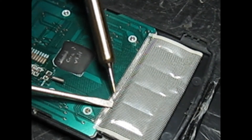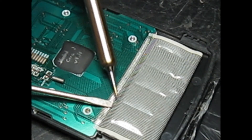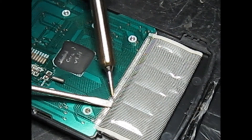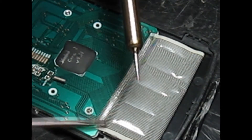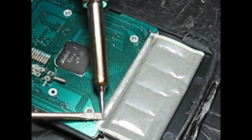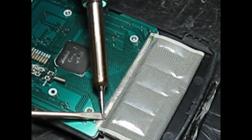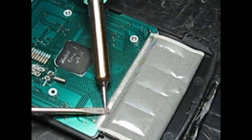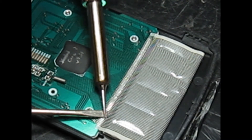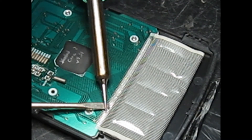Now, it doesn't always work, and you may actually have to increase the heat a little bit. But for now we're going to try and just hover over them, being very careful not to touch those pins themselves. What I'm doing here is pressing the soldering iron up against the screwdriver head itself, giving just enough heat that it doesn't melt through the plastic but still reapplies the layer. I have it set at about 400 degrees Celsius.